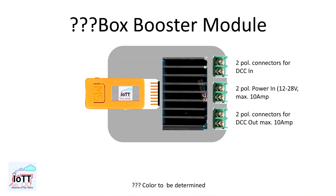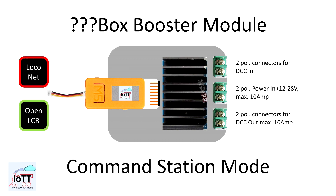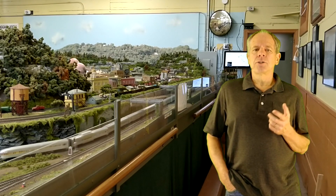For power heads: the booster head provides a DCC booster with fully opto-isolated input and up to 10 amps track current, an auto-reversing feature, and support of signal cutout for RailCom. In combination with an interface on the Grove port side, it may also work as a command station, but that's not a promise at this point in time.